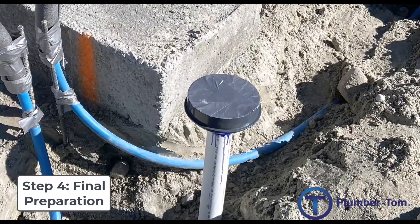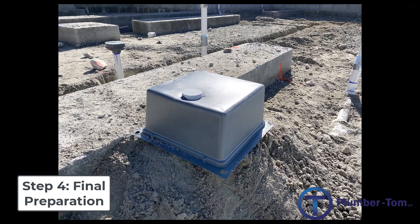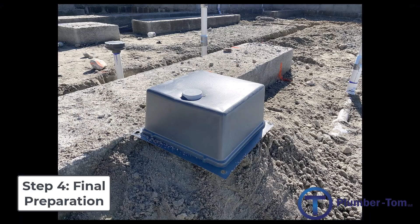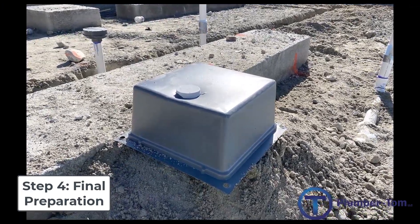But not too far — you don't want a massive crater in the concrete because the floor drain is too deep or gets buried altogether. Another important preparation is to box out for tubs, showers, or other fixtures that we need to connect the drain to later.